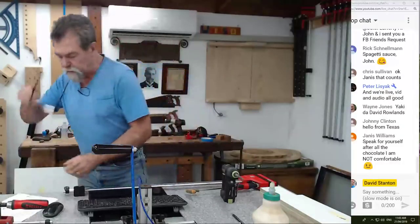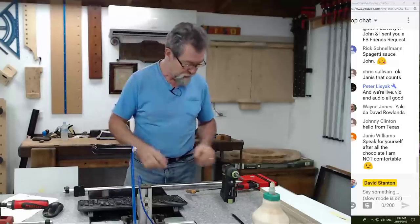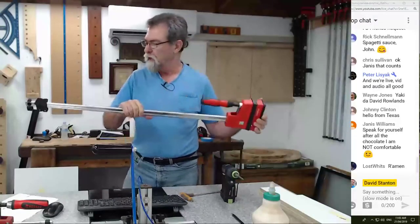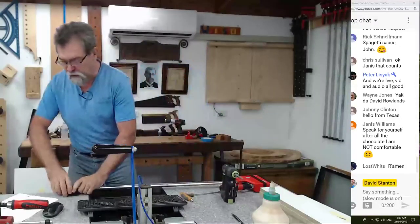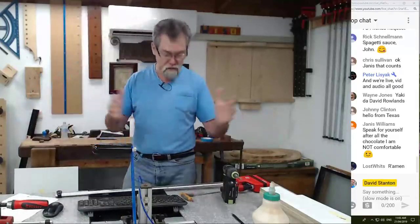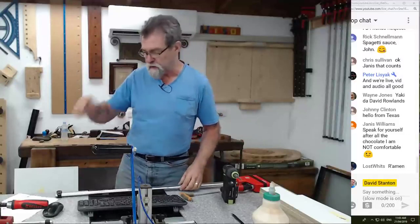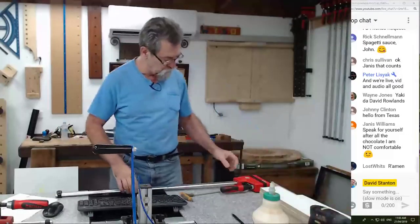What else are we going to do? It says, hey, it's 70 millimeters longer than you thought. And I am, of course, referring to parallel clamps. Now, this is something that people may be surprised. When you buy a clamp, sometimes you think, oh, this is an 800 millimeter clamp. Well, it's actually 870 millimeters. And I can prove that to you. I've got a tape down here, so we'll hook into this first.